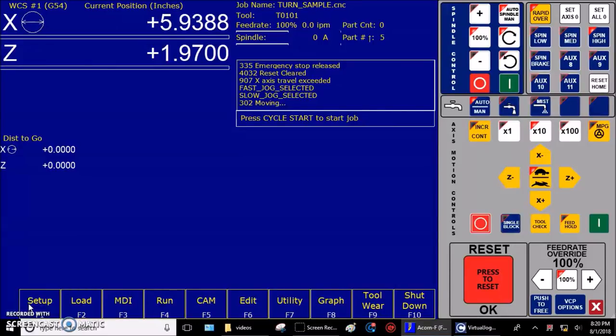One last thing we need to talk about is setting the reference return point. This is the position that your machine will go to when you press Tool Check. It's also the clearance point when you're writing your programs in Intercon. Basically, you want to jog your machine to a safe tool change point — a position where it can tool change and you don't ever have to worry about any collisions with the workpiece or the spindle. Then we're going to load some values in here to teach that position.